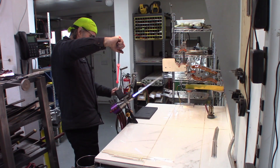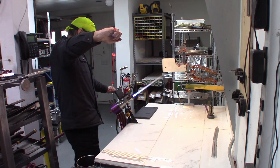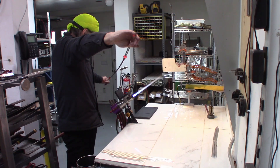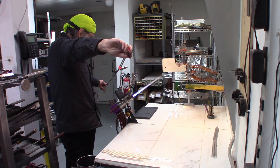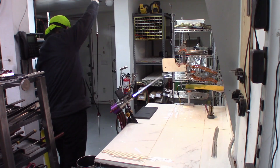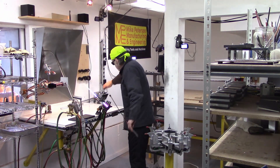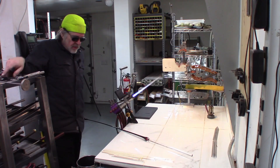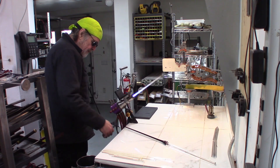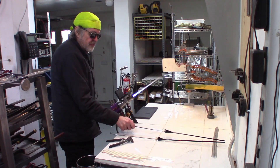It's starting to feel loose and floppy — getting almost ready to pull. I take it out of the flame, let it stabilize for a moment before pulling, and kind of blow on it when it's getting too thin. With any luck, I'll get a nice uniform pull. That appears to be — let me see if you can see it on the video — not perfectly uniform, but sufficient for the next step. I'll just nip that guy off. Since it's so thin, I think it's safe to bench cool this one.